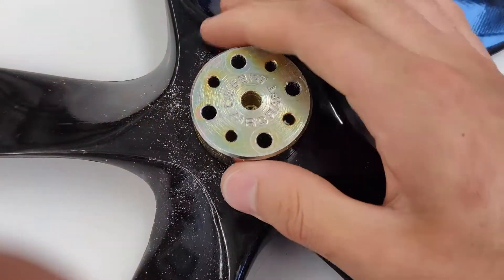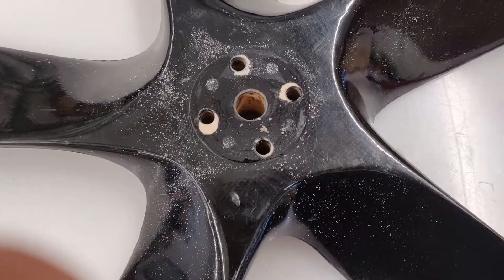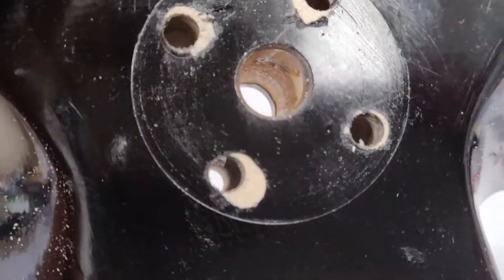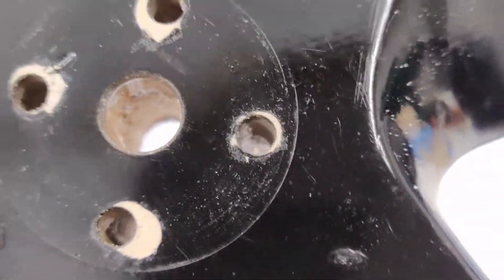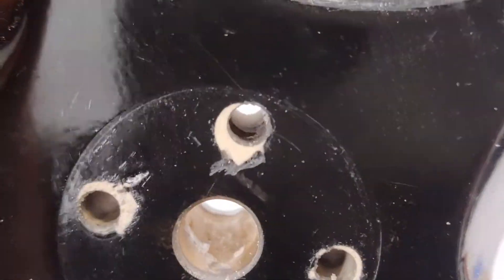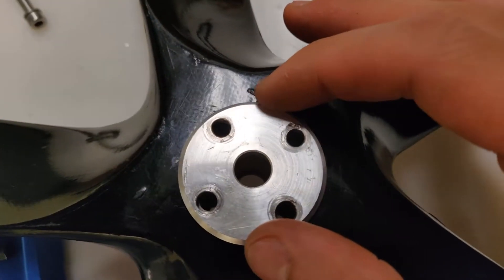Taking a closer look, we can really see how some of those holes were off-center. Previously when this was running on the aircraft, it vibrated really badly since it was forced off. You can really see that one of the holes is almost perfectly aligned and one of them is pretty far off. This was filmed probably a year ago and we've done quite a few flights with this propeller and it performs very well.